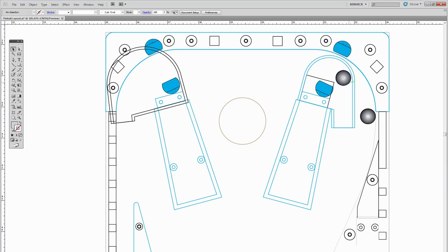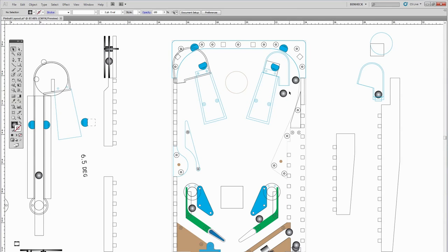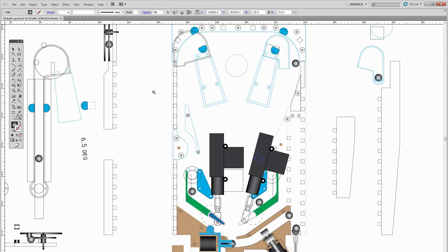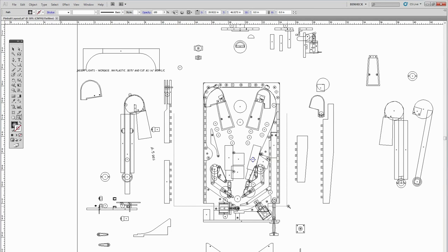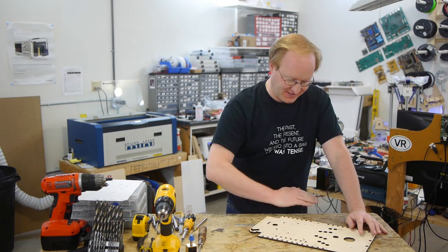Here are the ramp loops — the ramps feed into the loop and the ball will travel through and come down here. There will be receivers at the bottom and the ball will go on metal rails that we like to call habit rails. Then the ball goes down and is fed to the return lane. We have to keep in mind how large the flipper actuators are — we want to make sure they don't hit any lights or anything else. And finally, there'll be a case around it.